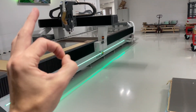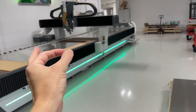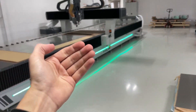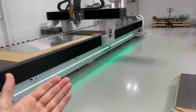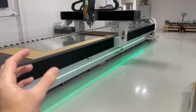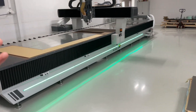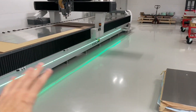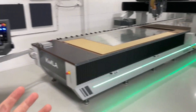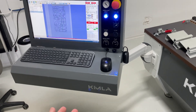So the machine can run uninterrupted and get the exact right amount of ethanol at all times. I can fine-adjust at the pump — it's doing 100 pulses per minute but you can adjust the stroke length to control how much ethanol you want. I've been testing this and I'm using way less ethanol than before, and with 10 liters I could probably run a week on that. It cannot be overstated how good this is.